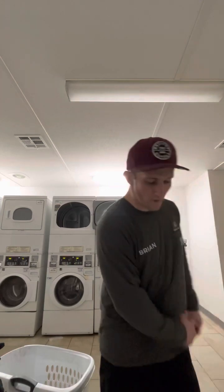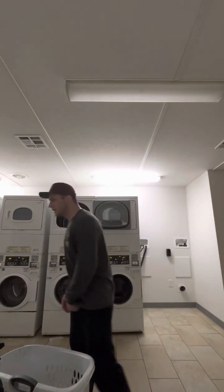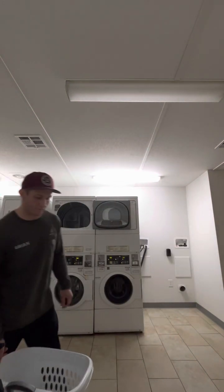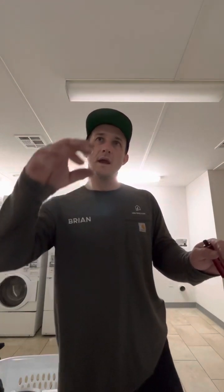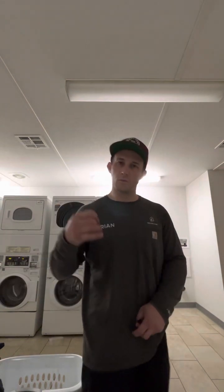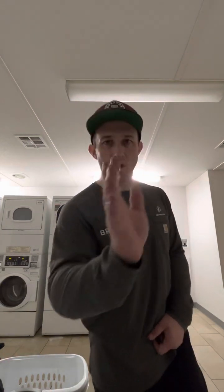See where you're at. And so when you've got those two lists, what I want you to do is take your wattage for the list that's just 120 volts and divide it by the voltage. So your 120 list, you come up with, say, 2,000 watts. You're going to do 2,000 divided by the 120. That's going to be your amperage. Document that on the piece of paper for your final answer for the 120 volt side.